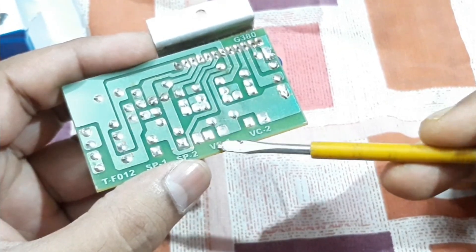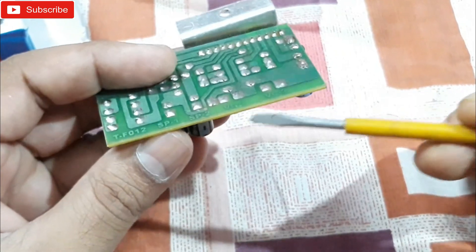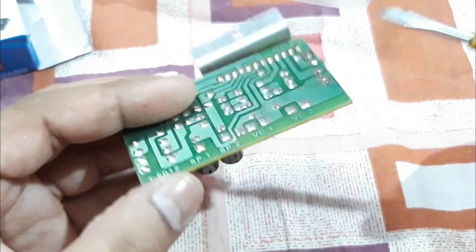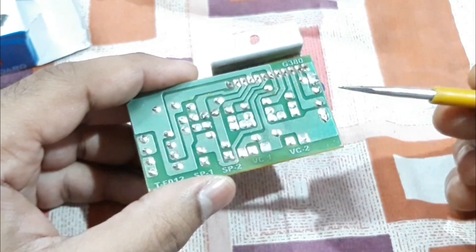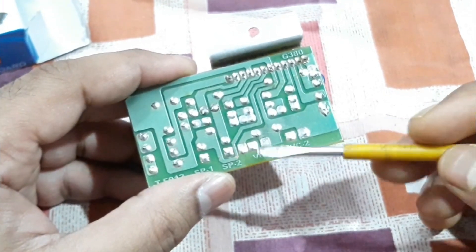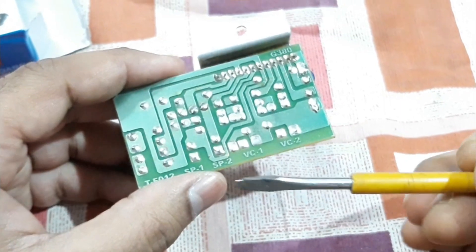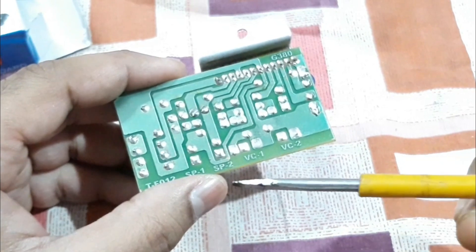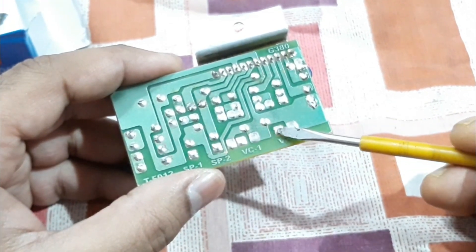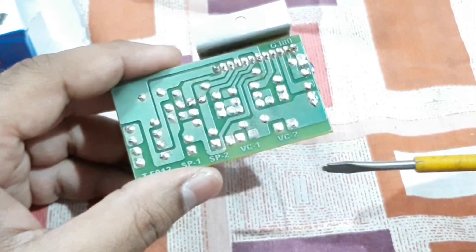For the volume control, you can see VC1 and VC2 inputs — VC1 is for the left channel, VC2 is for the right channel. There are small input resistors R4 and R5 at the input. If you're not using a volume control, simply connect left channel input here, right channel input here, and ground from your aux cable to the ground point. If you are using a volume control potentiometer, the left side goes to the aux input, the middle wiper comes to the left channel input here, and the same for the right channel. Both far ends of the potentiometers connect to ground — that gives you volume control.